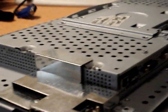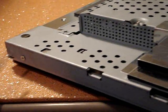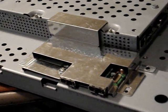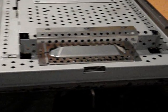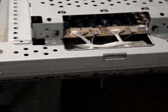Now to disassemble the monitor further, there are four screws — one here, one here, and there are two on the opposite sides. This panel does not have to come off. On the opposite side where the monitor control is, this little tab just lifts off. The other two fastening screws are here and here.